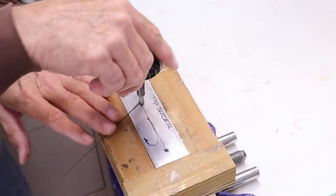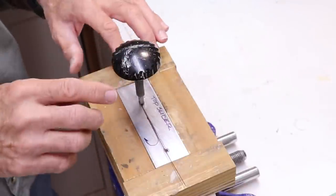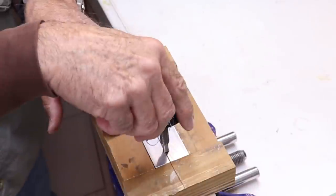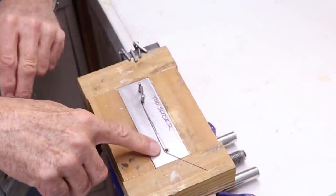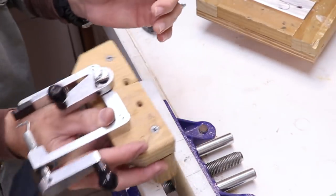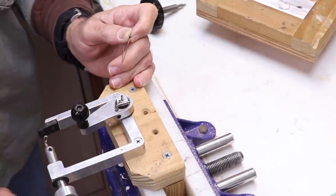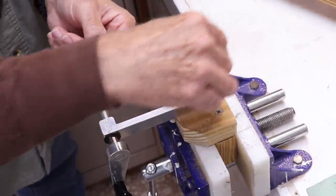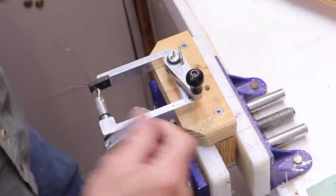This is a really simple one — it only has two bends. We'll make that second bend and get it to align with the long part of the harness, put another pin in to keep it in place. The last bend is just a little partial kink to mark where the twist eye is going to go. Then we'll take the twist-tech tool — I didn't make this by the way, but you can purchase them and I've got a link in the description. I'll align my kink so I can make a twist eye, put it on the twister, and twist on the eye.